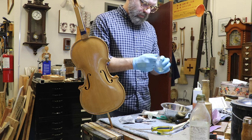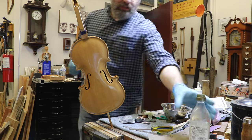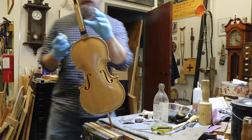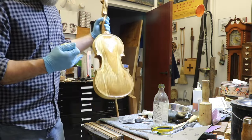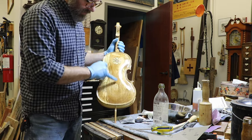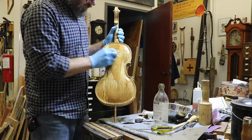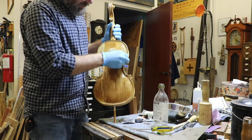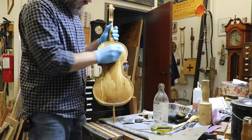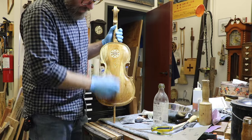And then what I will do, add just a little more alcohol. And I take a little bit of oil to lubricate the surface. Now eventually the oil comes off. So we'll see where we are here. I mean, this is already getting kind of shiny. Okay, I've been doing a couple of these here. So I put a couple of dots of oil, and I'm gonna quickly move the pad over the surface, and I'm depositing a very, very thin layer of shellac. So I'm smoothing it out over the whole thing,